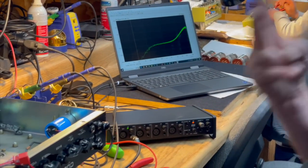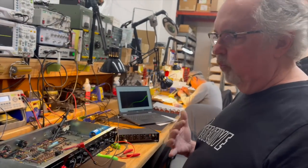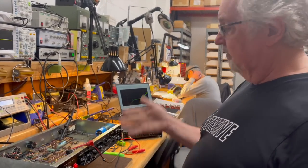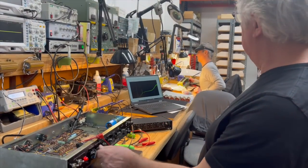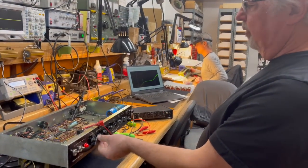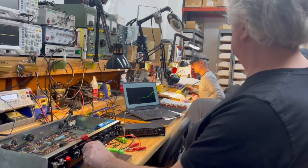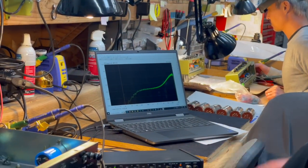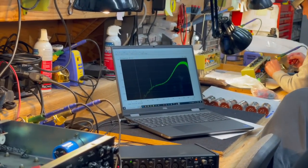the presence operates in two separate parts of the circuit. One part is at the stage that we tested previously, which we've now bypassed, so the presence doesn't do any roll-off like it did before. The only thing the presence affects now is the feedback going into the phase inverter, which is this. And that isn't as radical a bump as it was before.